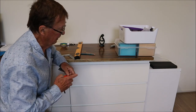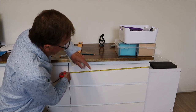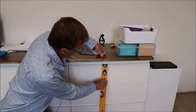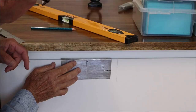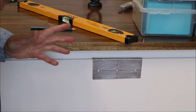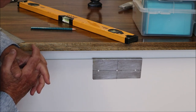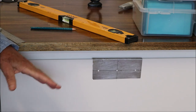Because I'm working off the center of my template, I only need one line per drawer. I pull my tape across — that's 80 — and make a line at 40. A shortcut I use is to take a spirit level, put it on that line, get it level, and then mark the other drawers quickly. You just line it up with the center hole in the template, put your block of wood behind, clamp it, and one person does all the drilling while another fits the handles. It goes very quickly and the end result is very neat.